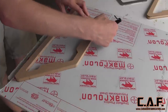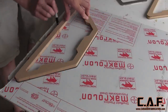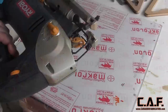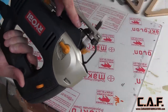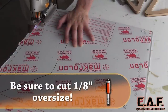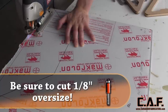The plexiglass that I'm using for this tutorial actually isn't plexiglass at all — it's polycarbonate. I like using polycarbonate because it's stronger, it's more machinable, and I find that it doesn't crack as easily as plexiglass. When cutting the plastic, you're going to want to set the orbital setting on your jigsaw to its maximum value. What this does is it pulls the blade back away from the plastic and only cuts on one side of the stroke, which cuts through the plastic much more easily.